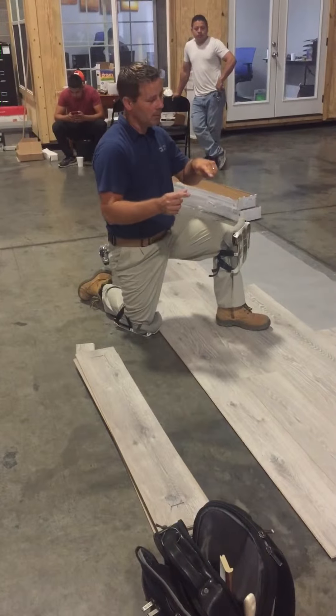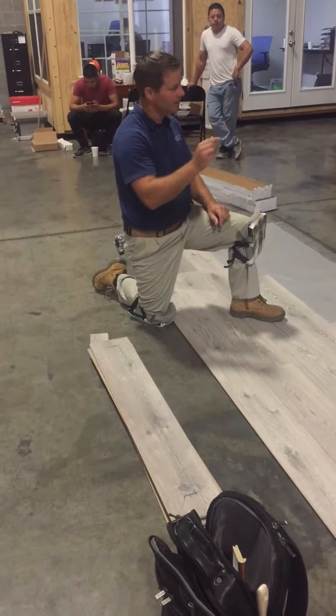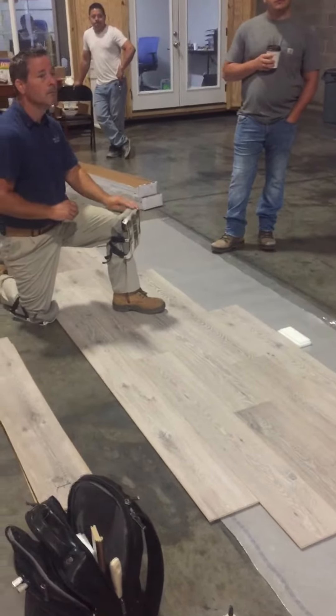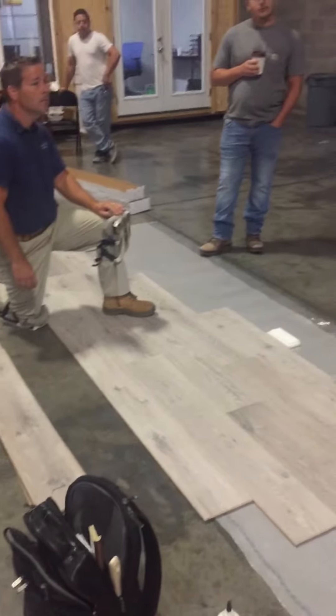Make sure you don't have a little piece of the jamb that didn't get cut by the jamb saw. A lot of times these guys will set the door casings up for you, but you still need to undercut it to be able to get into that framing underneath it before you get that expansion gap.